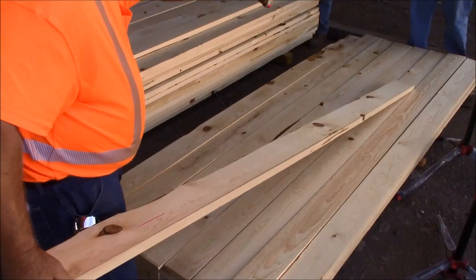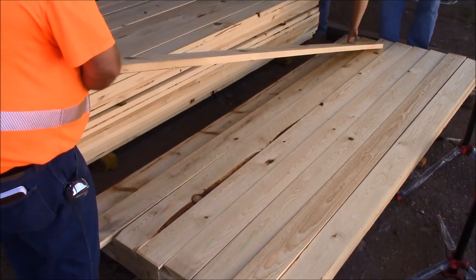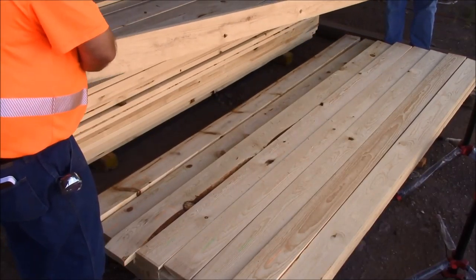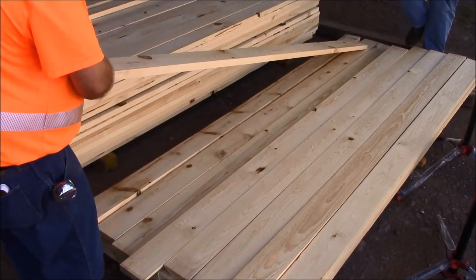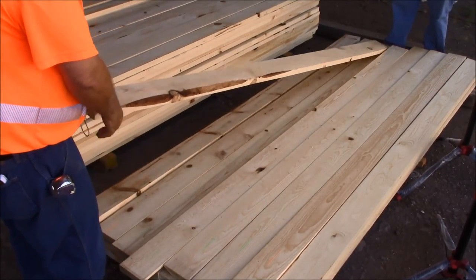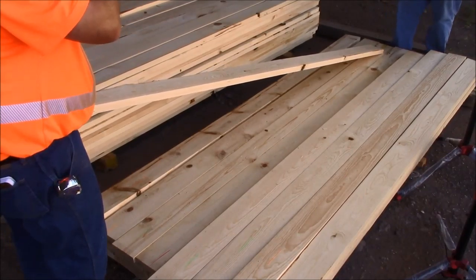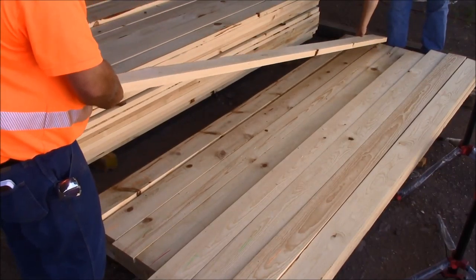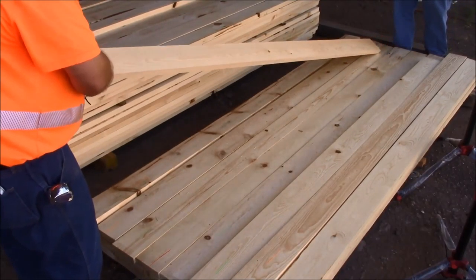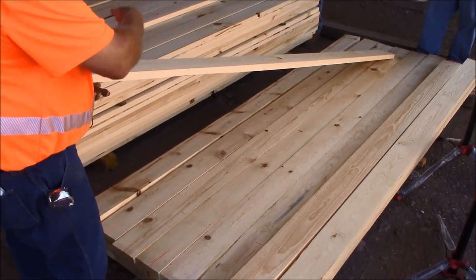The best thing will be finger joint in between the knots and get our 50% 10-inch and longer cutting. Same here — crosscut finger joint. Here we have to take sash cuttings down that edge all the way to the center and cut the knot out and keep going. Here we take sash cuttings down one side, back here we come with another sash cutting — 3 shop. Same here with wane down one edge — the only thing we have is sash cuttings and we do have enough of them. We have enough for finger joint cuttings down the other end, so it will be a 3 shop of finger joint.